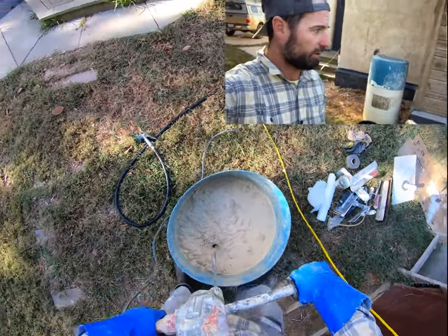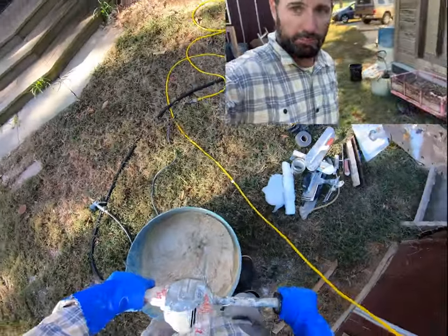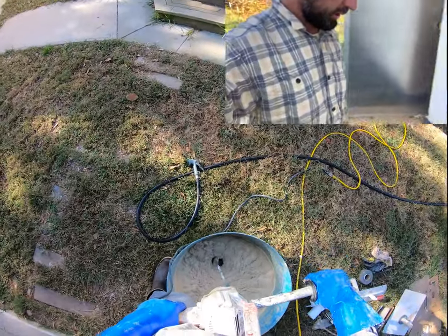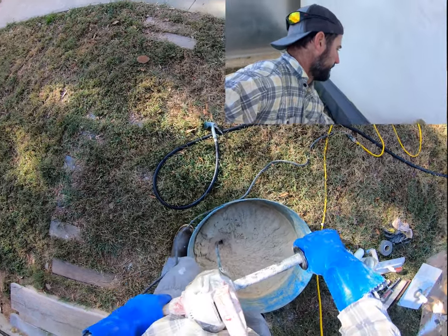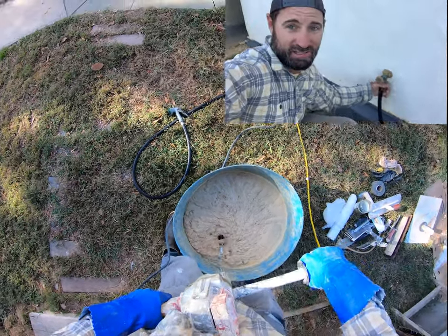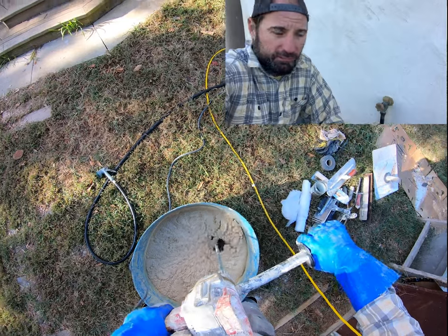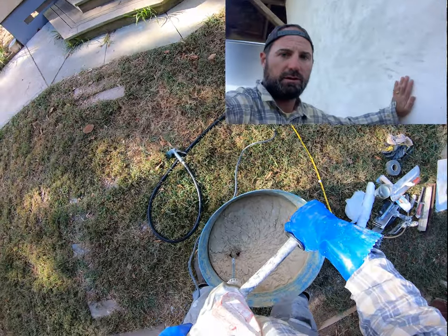And so like the first coat, I'm going to grab the hose and we're going to wet the plaster down, because right now it's been a couple weeks and it has fully cured. It is really dry and it's going to suck up a lot of moisture. That is why I'm going to make this lime plaster mix a little bit wetter, because this is the final coat on the west wall.